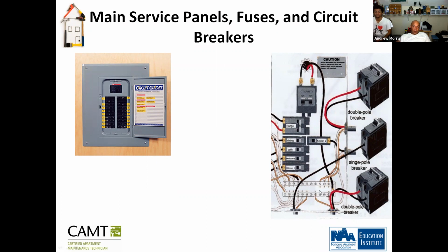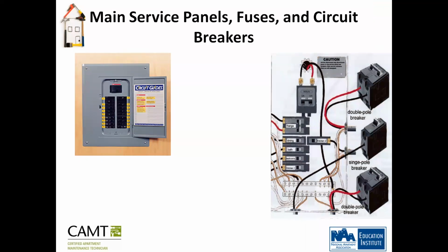All right, so if you can see here, this is a double pole breaker. This pretty much is always used for, let's say, a 220 dryer, 220 air conditioner, anything that requires 220 voltage. This right here is what you're going to install. Same thing here as well. So here go two hot wires, two positive wires go in here, and the neutral goes where? The bottom. What's the bottom called? I forgot. I just said it. The neutral bar. Neutral bar, okay.